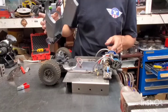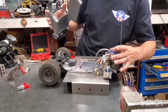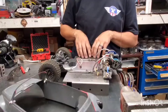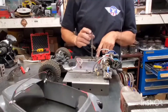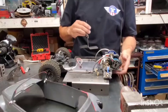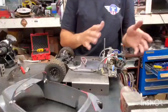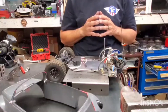I cut it and lined it up on this side and marked it so I can cut it so they're symmetrical — when we do the bumper everything's going to come out at the same point. This is how I used the fixture table to hold the tabs while welding, and then I used the fixture tower with the nest tab to hold these in place while I welded it. I had this on the table, set the chassis on top, then set the body on and lined it up until it was where I wanted it, removed the body, and welded it on.